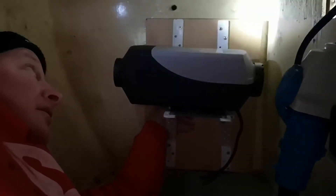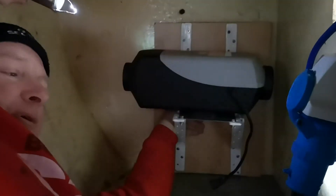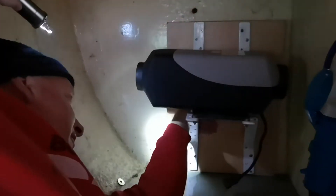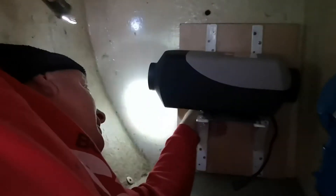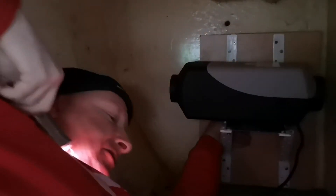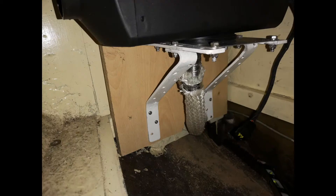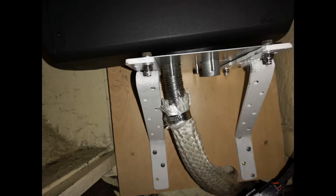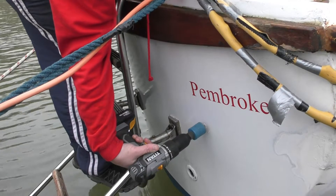So what we're doing is installing the heater. My original plan was putting it over here somewhere but it's not really worked there because of all this electrical gubbins. So the new plan is to stick it at the back bulkhead here. Should have sufficient clearance - we need 30mm but we've got way over that at the moment. The headache will be this side, whether we've got enough to get the turn for the pipe as it comes out. The other problem was access to the area where the pipe was going to track through - it was impossible to gain access, so some form of insulation on the exhaust became absolutely vital, and that's a real headache we'll come back to.